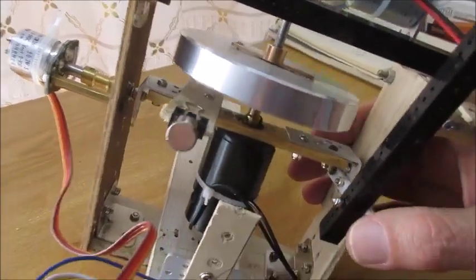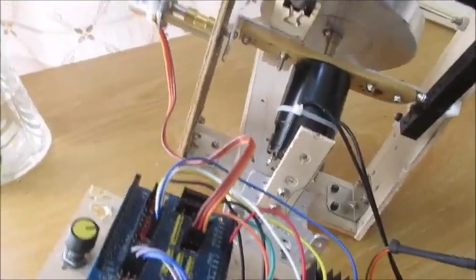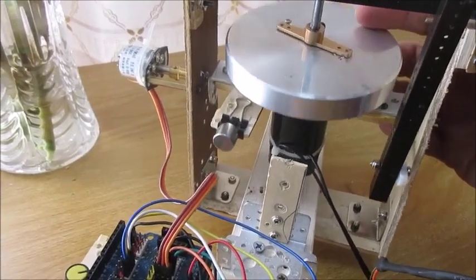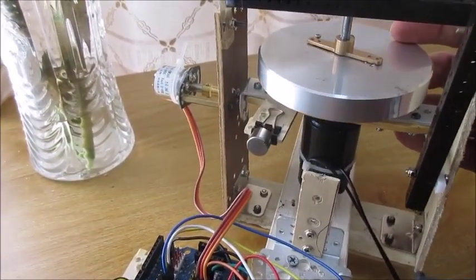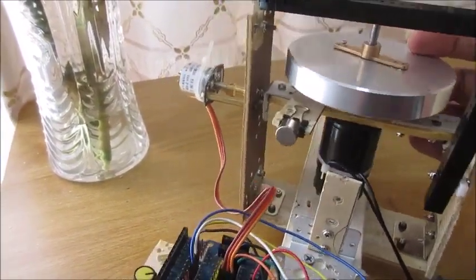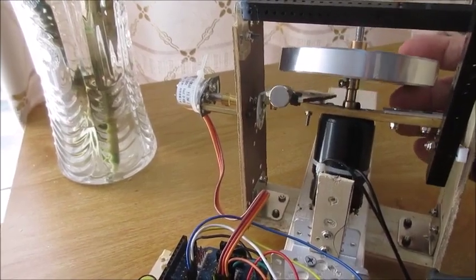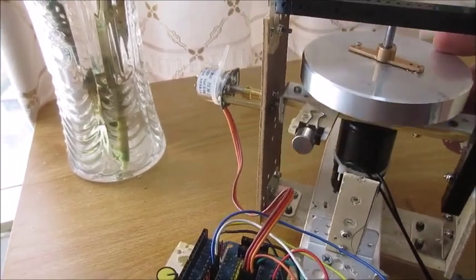That's the purpose of the electronics here. Another point about a gyroscope self-balancing a vehicle: the gyroscope has to be top heavy. In other words, there has to be more weight on the top than on the bottom. That's the only way that precession will work. If the bottom is heavier than the top, there's no precession — it's impossible to balance it. So this one is top heavy, and that's what allows this natural precession cycle to take place.